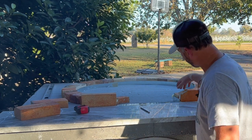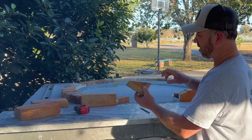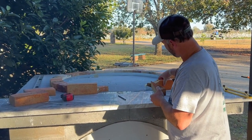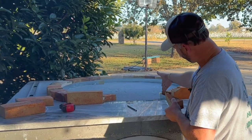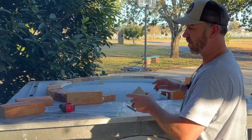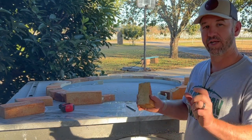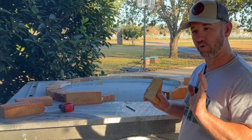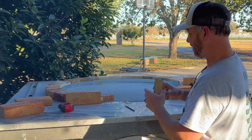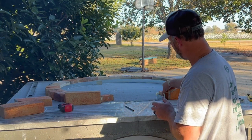As I'm coming here to the front, I have cut these bricks at an angle that will lay against my bricks here but then square off the front of my entryway. My entryway is going to be 18 inches wide, and my outer entryway is going to be 20 inches. That's so that I can have a one-inch lip whenever I put a door up there that will seal against the face of the inner bricks.